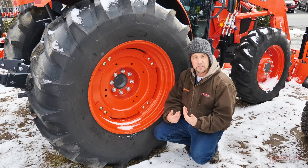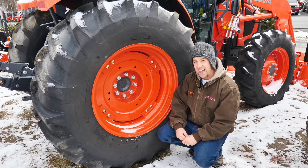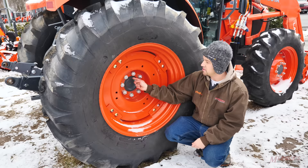The final critical mistake we've seen customers make is not remembering to check the lug nuts on their tires. When we do the setup process on one of these tractors, we go through and use a torque wrench to torque all of them to spec. You need to realize that as you start to run a machine, it's going to break in and things are going to wear. Your owner's manual will actually recommend that after the first couple of hours, you go around with a torque wrench and check these lug nuts to make sure they're still tight. We've even seen customers not check torques for 100 hours or so, and egg out the rims a little bit. It is something that happens and it is your responsibility to keep up with. You ought to have a torque wrench somewhere in your garage.